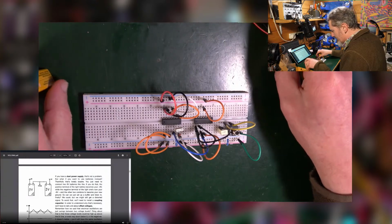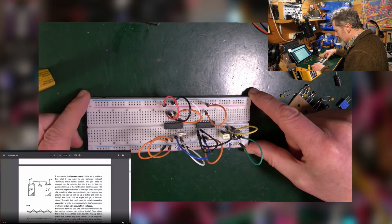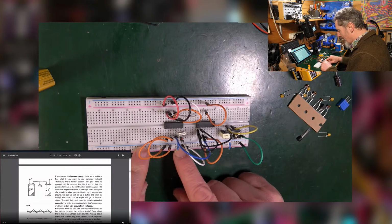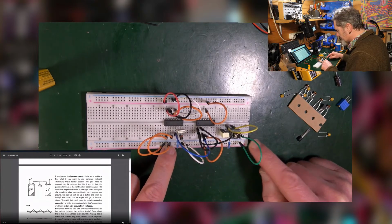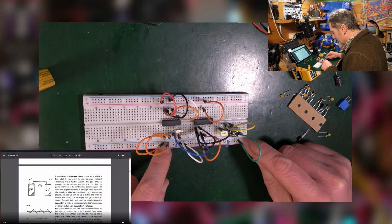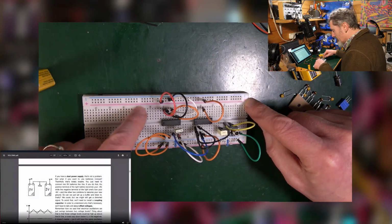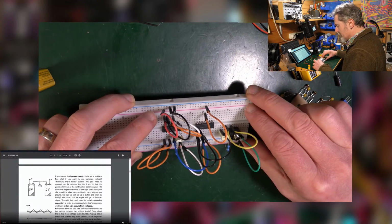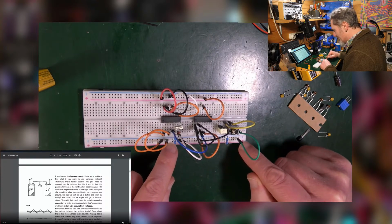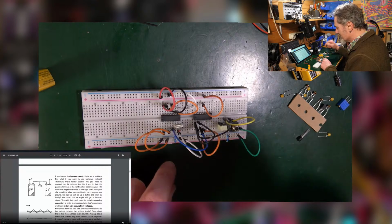Okay, so when we're talking about this breadboard, if we're creating 3 rails, and we've already talked about the resistor going to ground, which is this line here. Although it's labelled negative, we know that that's supposed to be ground, which is supposed to be 0 ultimately. So this blue negative one here needs to be 0. This positive red one here can be +9 volts. And maybe when he's pointing to this bottom row, he means that this bottom plus one is actually going to be -9. Have I got that right, people in the chat?